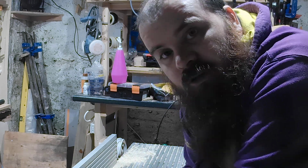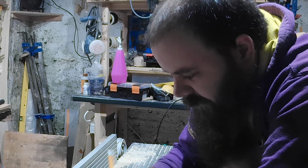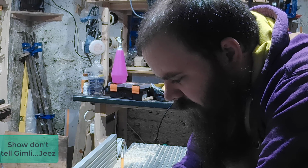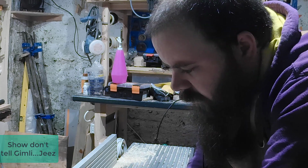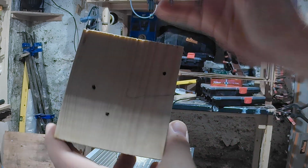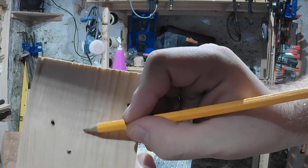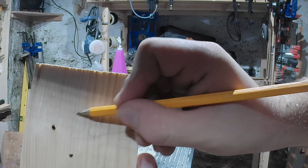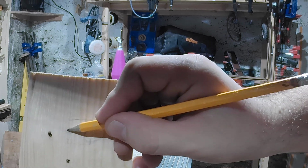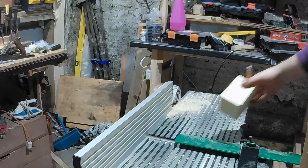So, the principle you're going through here, which I think I didn't explain well, you're using the same idea of the little man, as I always call them, a P and a V, whatever you want to say. When these come in, these are blocks that are cut deliberately to be used for this job. So they're often kind of like this because of the expansion and contraction. So what we're doing is we're taking the best two edges. I say this one's a bit straighter, and I'm marking that as my face. Then that's all I'm putting against here.